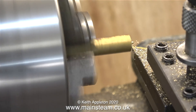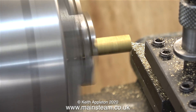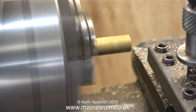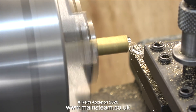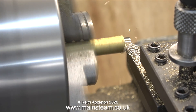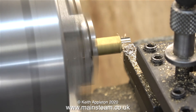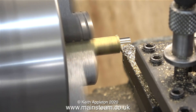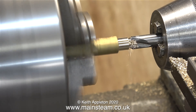For the injector. In this clip I have a piece of hexagon bar in the chuck — first job, face across the front. This piece of hexagon bar is the same size as the hexagon bar used to make 5/16 by 32 threads per inch union nuts. I'm turning the piece of bar parallel for part of its length. When it's fitted to the tap, the total length of this fitting needs to be 5/8 of an inch. This part of the job I really don't need to do because it would work fine just by fitting the hexagon straight onto the steam tap, but it wouldn't look so good, so I'm doing it this way.